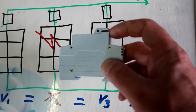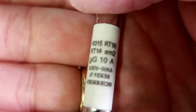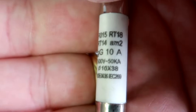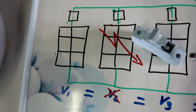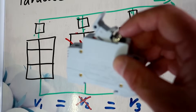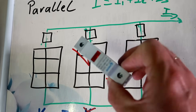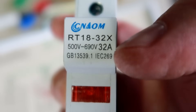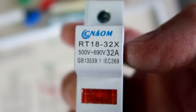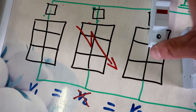The solution is to put a fuse in each of these solar panel connections. This is a holder for fuses. You open this one here and inside we've got our fuse — this is an RT18, which is just the size — and you can see it's 10 amps. Because we've got 5 amp solar panels, the 10 amp fuse will work perfectly in this system. You put the fuse in, close it, and it looks like a circuit breaker — pretty much a similar function. It disconnects your circuit if we go over 10 amps. This fuse holder is rated up to 32 amps, and eventually we will have three of them installed in our fuse box on the garage — one for each panel.